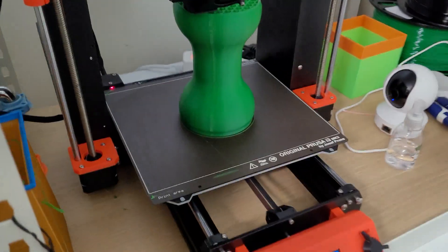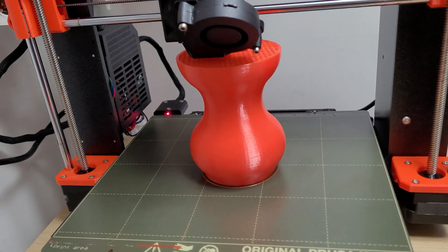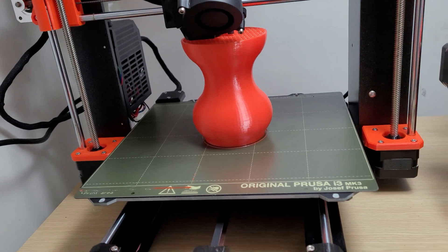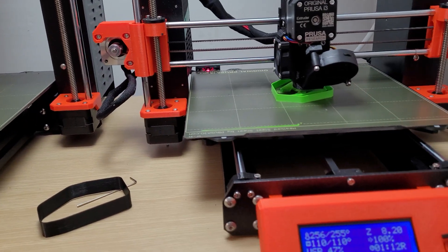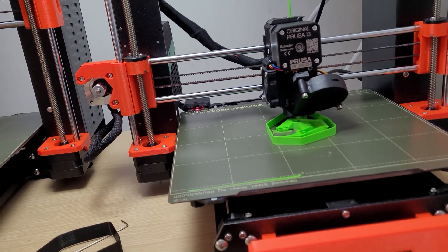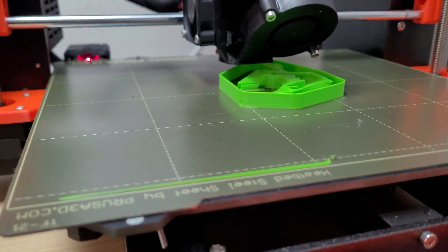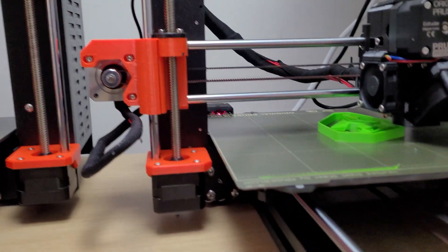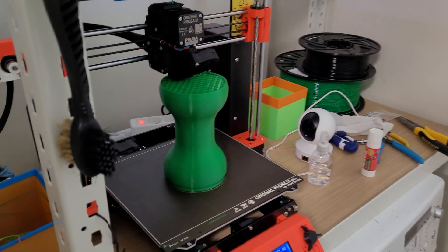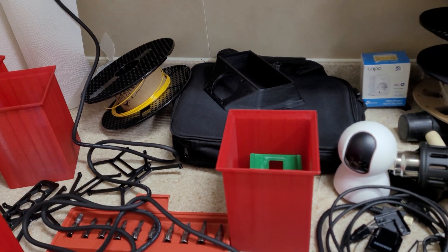I know this because I've been developing this back roller for a few months. I'm printing everything with the 0.4mm nozzle and this printer just prints perfect. I still haven't found the right combination of settings for the 0.6mm nozzle in Prusa Slicer — it prints with a lot of stringing. I'm printing ABS, and this is a hardened steel nozzle, a cheap Winsun one I bought. You really don't need expensive nozzles, but use a good printer.